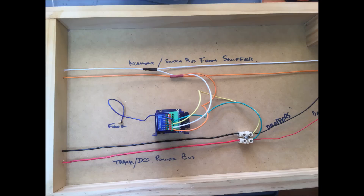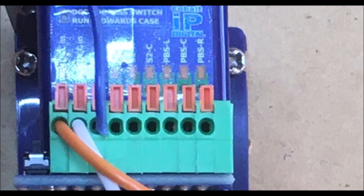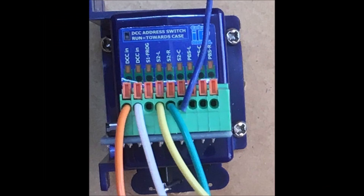So this is what we end up with — the final wiring configuration. We've kept the orange and white wires going into the DCC inputs on the motor. We've taken the frog wire and moved it across to the S2C terminal, which provides the power to the actual electrofrog. We've taken two power wires from the track DCC power bus — the green and yellow ones — and put them into the S2L and S2R on the motor. So essentially we've gone from two wires to a total of five wires, and you can see which ones go where. That has fixed the problem.